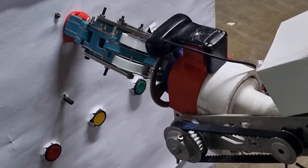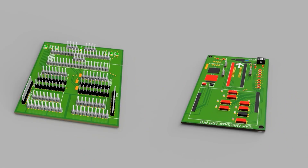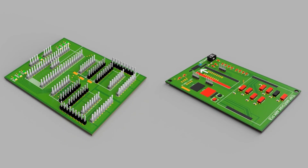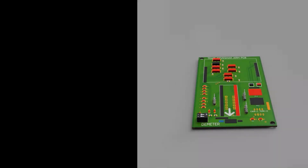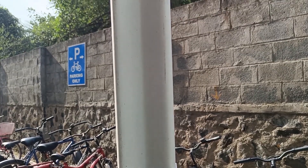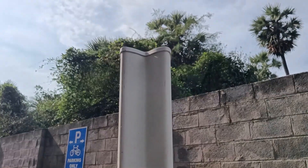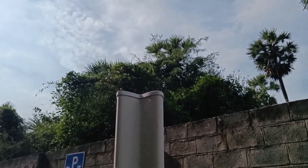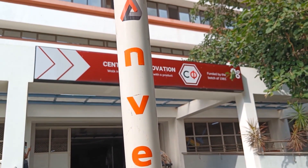The shift to CAN bus for the manipulator reduces noise in the communication. The PCBs were newly designed and optimized this year to reduce the number of cables and wires, along with an LED-based indication system for easy debugging. Our communication setup consists of a directional antenna at the base station and an omnidirectional antenna mounted on the rover operating at 2.4 GHz. The setup is capable of communicating over a distance of one kilometer even in the absence of a line of sight.